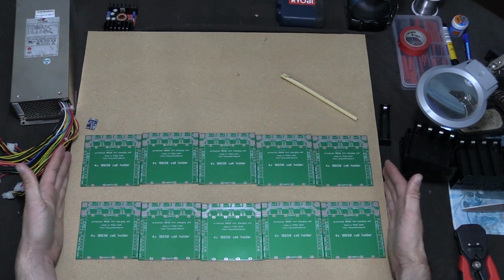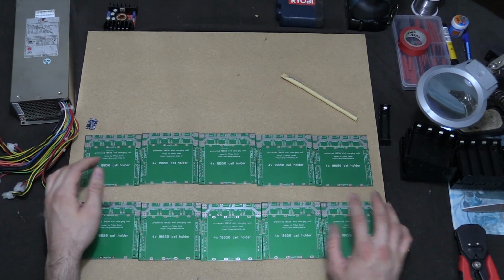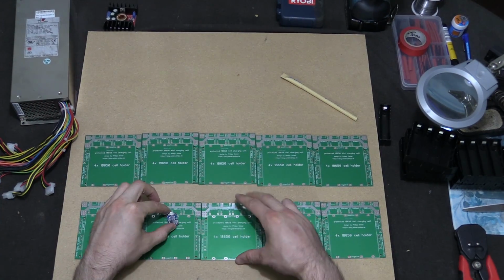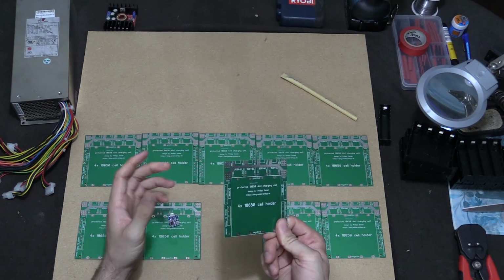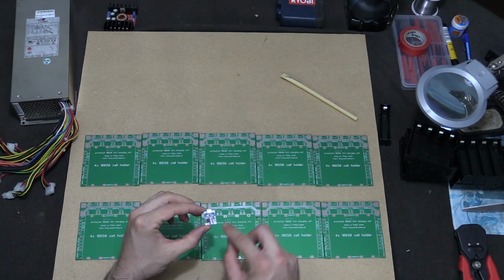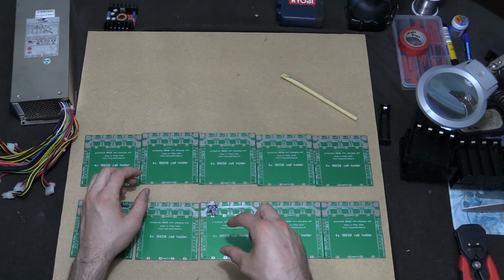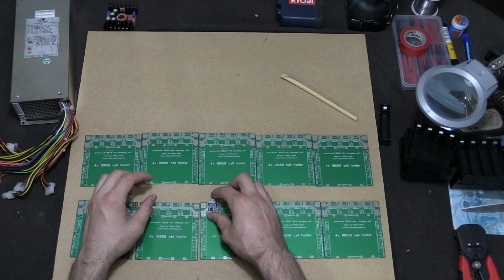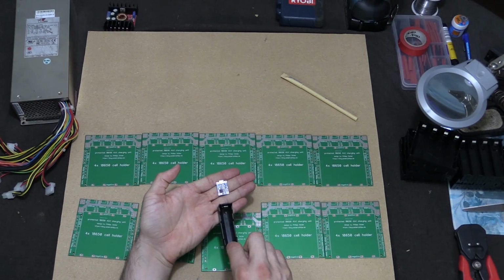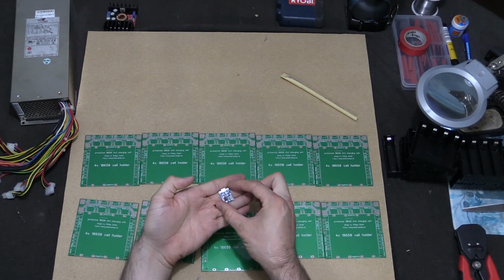What I want to do is try and keep it on this nice piece of wood that I've got here. This will look much nicer on the wall than my existing one. Obviously, to power all this, these are all 5 volts. One thing I'll mention very quickly is that even though this says protected 18650 board, it's only protected by fuses. It doesn't help at all, really, because the charging circuits have no protection on them at all. As soon as you put your cell in the wrong way, the charging board blows. So just like if you were to do it the traditional way, with a cell holder and a TP4056, you need to make very sure you put your cells in the correct orientation, otherwise you end up blowing the boards.